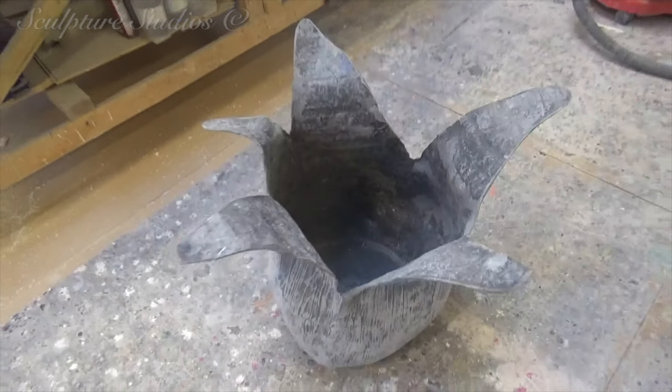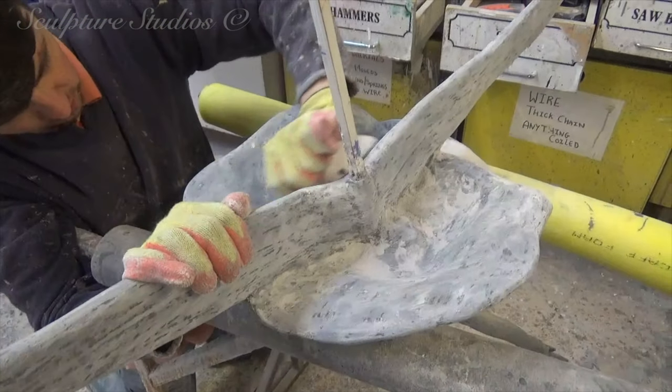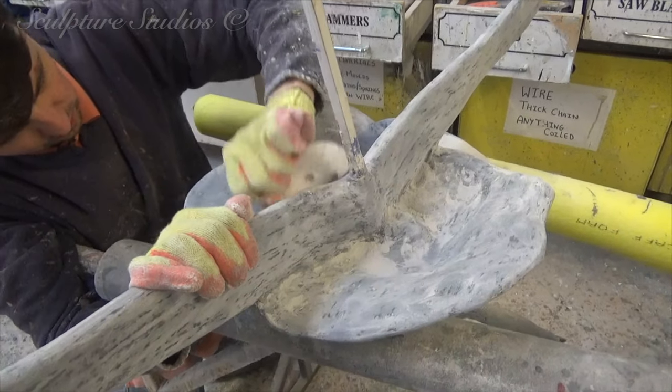When going over with flow coats of resin, everything needs to be sanded down properly, whereby the larger areas we can often hit with air sanders, but the tighter areas need to be tackled by hand.